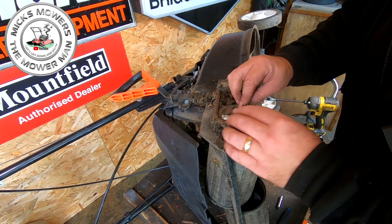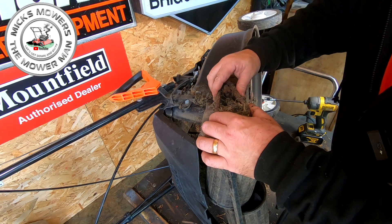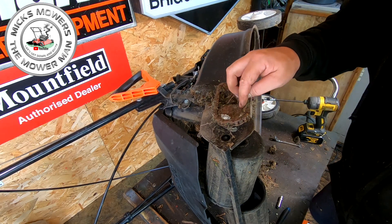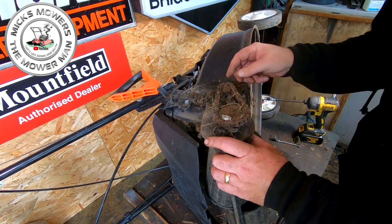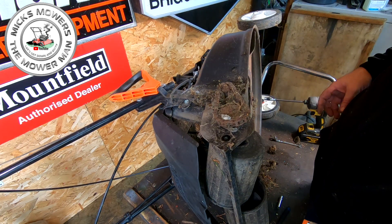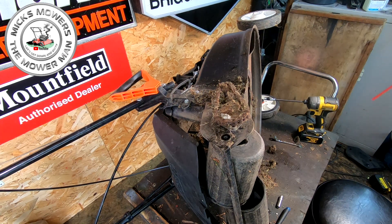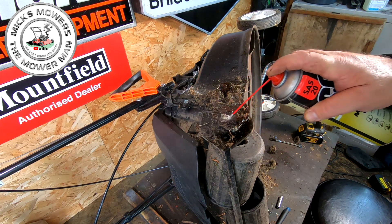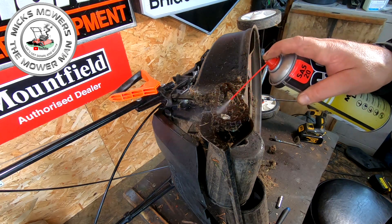Let's get my air gun and clean that up inside there — there's loads of grass and muck in there. That guard comes off of there; got a 10mm there as well. So we're now getting to the bones of it. It looks like there's a bit of wood in there as well, Paul. This one's going to need a good clean and oil soak because that chain is absolutely solid. We might have to get a new chain, or we might be able to save it — we don't know yet. There's a bolt up there too; I'm going to try and loosen that bolt and see if it won't retract, so a bit of penetrating lube going on.